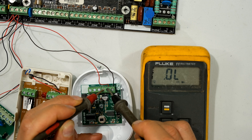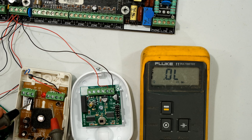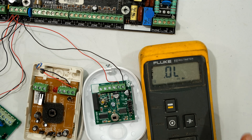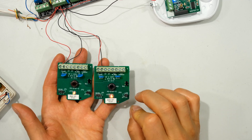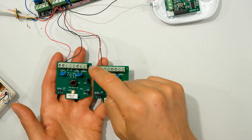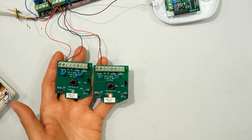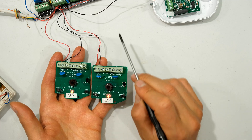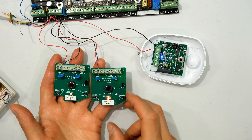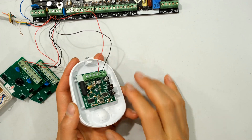On the working sensors there's no volt drop across the output terminals because they are galvanically isolated - it doesn't matter which way I put my leads, there is no voltage. This type of faulty unit is not using a mechanical switch - it's using a solid-state switch. Because of a voltage surge on the positive input terminal, it destroyed the output stage. This also implies a surge could go back into the alarm system and damage the zones, although I'm speculating since there's no visible relay.